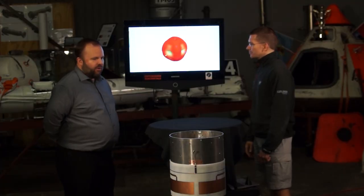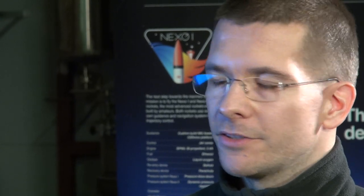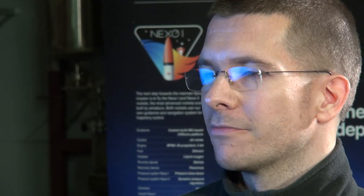I'll hold the electronics group to that point. This has been a very useful insight into this little exotic world of antennas, and it's really nice to see — it's an experiment, but an exotic one. At the moment we are testing the resonant frequencies and we are a little off, but we can get that straight with a little tuning. A little copper tape — that's what's in the box. We're going to do some simple tests, tilting it to see if this down-looking angle is okay. Unfortunately we don't have the facility to make a measurement plot like the simulations, but it should be fairly close. I'm very much looking forward to seeing the results.